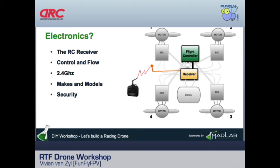In our club, 99% of people fly 2.4GHz receivers. The old standard was 72MHz where you could only have about five people flying at once using frequency pegs. Now with 2.4GHz everything is digital — each radio and receiver pair has a unique digital key, so my receiver will only listen to my radio. That's why we can have 100 radios flying simultaneously on the same frequency.